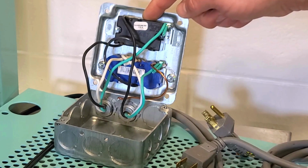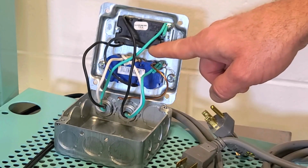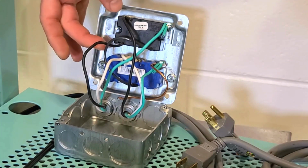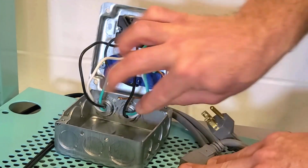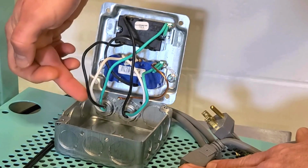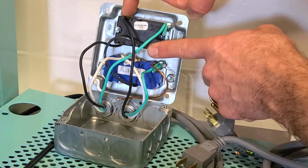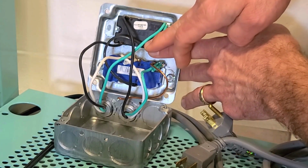so this was a light switch. It's a 3-way light switch. So there's one common port, and then there's two other ports, screws. So I have, this is one cord, this is the other cord. So one cord goes to one screw, the other cord goes to the other screw. When I flip the switch, say it connects this one to this one, and I flip it the opposite way, it then connects this wire to this wire.